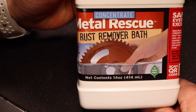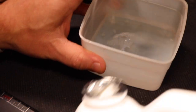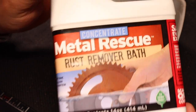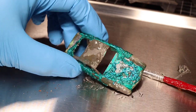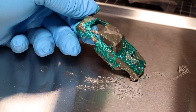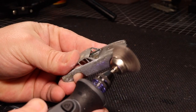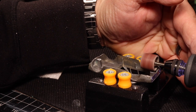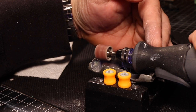To take care of the rust I'm going to try some of the Metal Rescue. Just enough for the base. The nice thing about it is it can be reused over and over again. Then I'm going to use the Dremel to flatten out the posts — they had a little bit of the mushrooming left. So in order to get the base on relatively easily, I'll sand them flat.